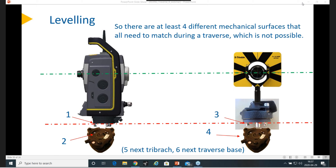How do you do a traverse adjustment using Trimble equipment — like in Trimble Access or in office software? I typically just do the rounds and then bring it into TBC — Trimble Business Center — for further processing. That's what most people do: measure rounds in Trimble Access and then do the adjustment itself in Trimble Business Center, our office software. But if you do want to do the adjustment in the field, it's in the Cogo menu inside Trimble Access.